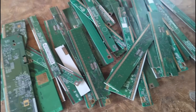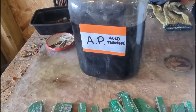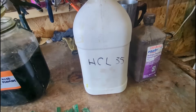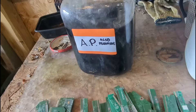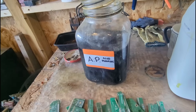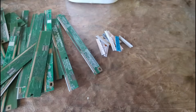I've got the boards removed from the tin solution and rinsed off - the majority of the solder is gone. I've got my AP (acid peroxide) solution; I've used this several times for small amounts of boards and stuff like this. AP is simple and easy to make - if you don't know how, it's basically a 2-to-1 ratio of hydrochloric acid and peroxide. You don't need to measure it out precisely. As long as we're not boiling it - we're not even adding a bubbler - there's zero chance of dissolving any of our gold with this mixture. I just get the gold foils, filter everything out, stick a piece of iron in there to cement out the copper, and use it again. So now I'm going to get all the boards added into the AP along with our ribbon cable ends.